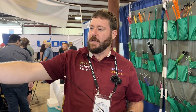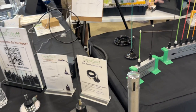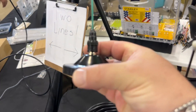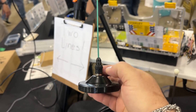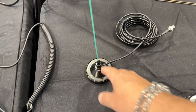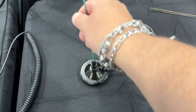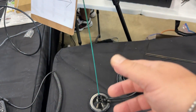We've also got some mobile antennas — there's a half wave and a quarter wave NMO mount. Here's my BNC mag mount. If you're already using a BNC adapter on your radio or you have a BNC radio, you pull the signal stick off your radio, drop it onto the BNC mag mount, slap the mag mount on your roof, and then plug the coax connector right back into your radio. It's pretty much the fastest grab-and-go option I know of. This is what Jason KM4ACK uses on his car. And these are 100 watts too — I don't know if a lot of people know that.